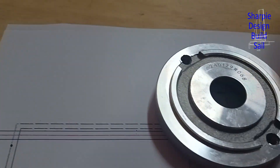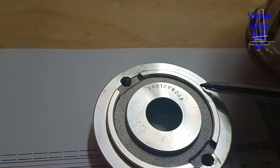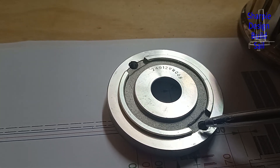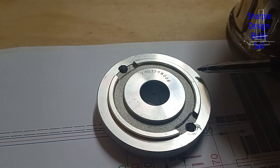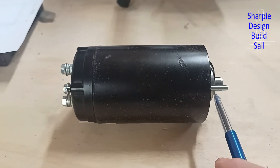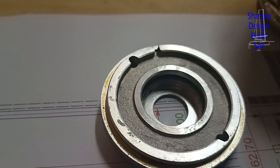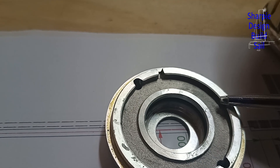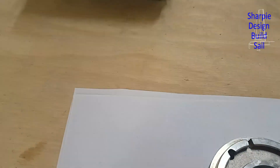I'm going to countersink some screws into them, so I'll be mounting the plate on here before I mount the motor. On this plate here I'll be making some new holes at probably 90 degrees to these holes. I'll be making two new 5 millimeter holes so the bolts can go through and actually mount on this side. It'll be a bit of fun because there's a spigot there, so drilling holes on the edge of a spigot is not easy.